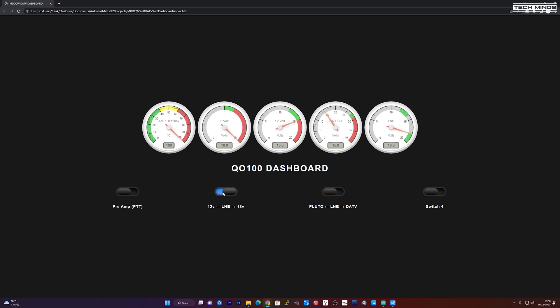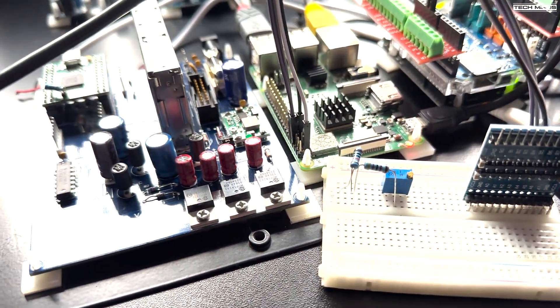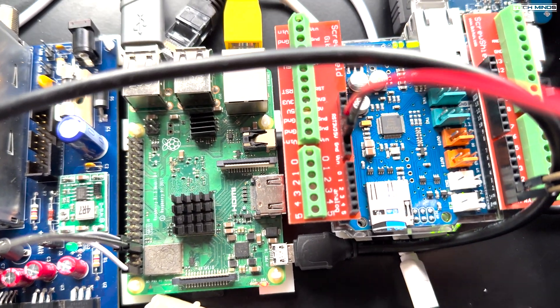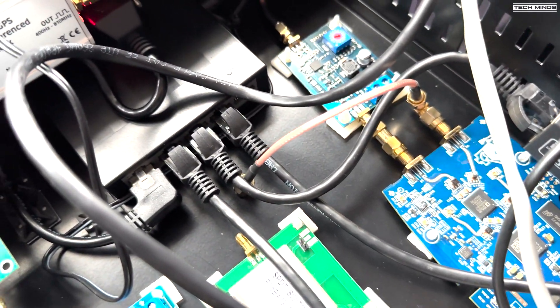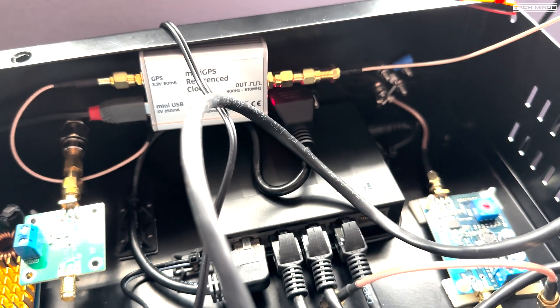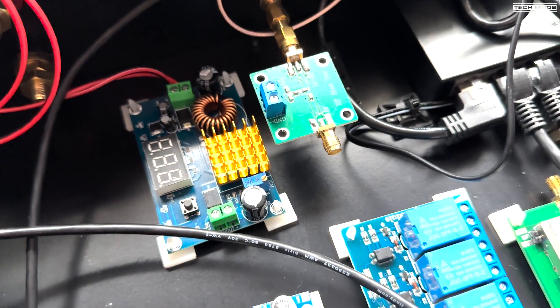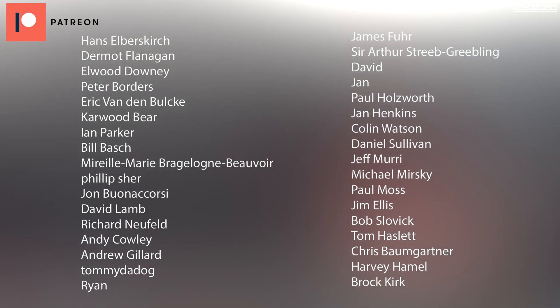So it's an interesting project. This is part one — I'm sorry if I've bored you, but it's taken a lot of my time and I'm really enjoying it. I just hope it all works when finished. On the back panel: the preamp goes to an N-type, the GPS antenna is an SMA, the bias-T is an F-type connection, and there are two big power connections. I still need to drill a hole for a fused mains socket going into the power supply. Anyway, this is the beginning of part one of my build — I'll document it and show you everything as I go along.